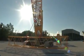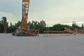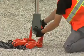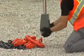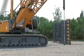Now, connect the various jib sections with the jib head using pins and then connect the pendant straps. The assembly work using the cylinder is now completed and the rigging can be removed and the cylinder tied to the boom foot.